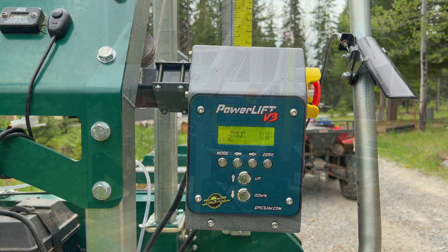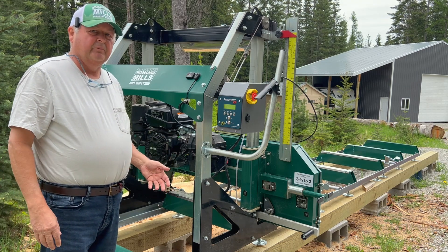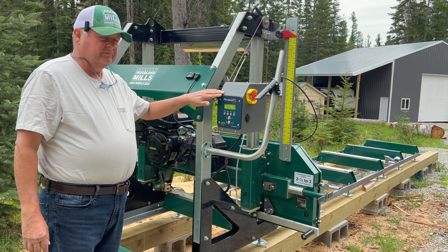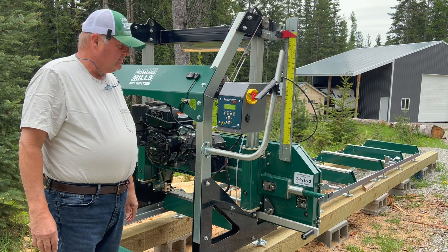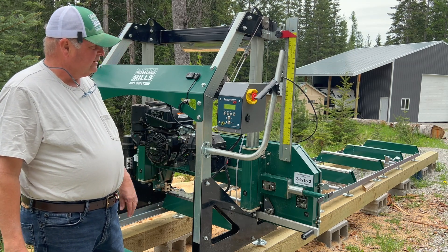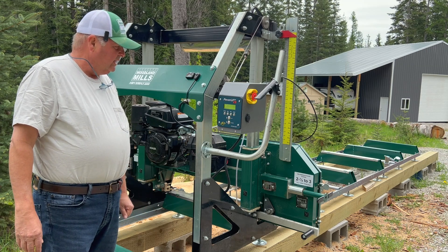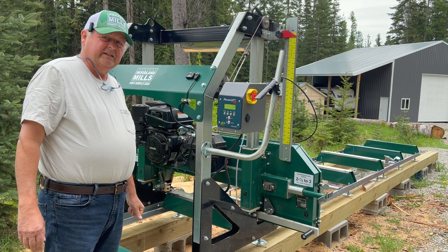That's how you do the calibration. You'll need to play around with it a little bit. If you do get a hard limit error, readjust the sensor so the light goes off, restart your power lift, raise it up a couple inches, and try it again. I did it several times to get the hang of it. I still need to learn how to use it, so I've got some more experimenting to do, but I wanted to get this video out for you guys. Thanks for watching — like and subscribe, and I'll see you in the next video.